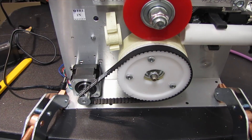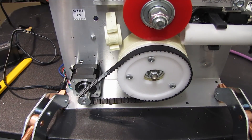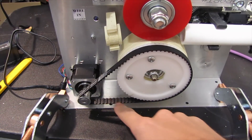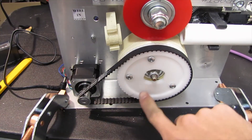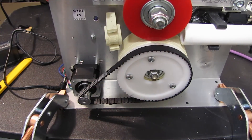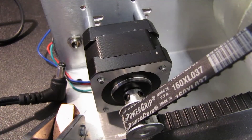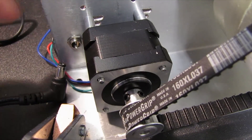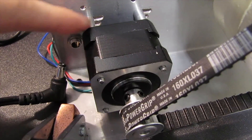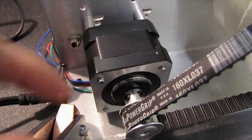Originally the drive mechanism was going to be just a wheel rubbing on the stock measurement wheel, but there was way too much slippage, and when you're measuring you can't afford any slippage. So I grabbed a timing belt, a plastic timing belt wheel, and a very tiny timing belt drive wheel for the stepper motor — all from McMaster. This ensures there's no slippage when the stepper is counting. The stepper is mounted with M4 screws through a slotted aluminum back panel for tension adjustment, with hex standoffs to space the motor so the two wheels line up.